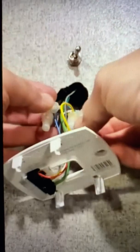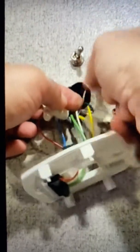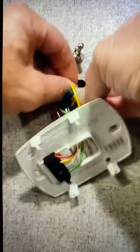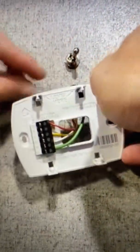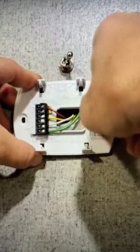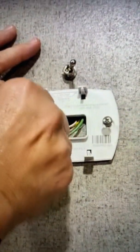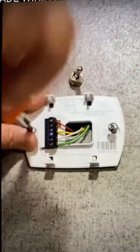So let's put the whole thing back together — pretty simple. You've got the wires that used to go to the AC: the gray and the green go on either side of the toggle switch. The center wire can be any color and plugs into the bottom. Tuck all your wires back in. I don't think I need to tell you to kill the power before you do this. I turned off the breaker down where the fuses are — that may not be the right way, but it worked for me.